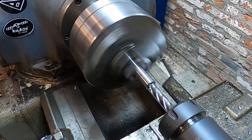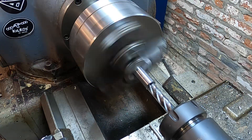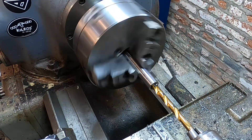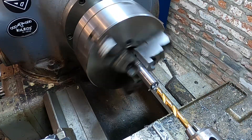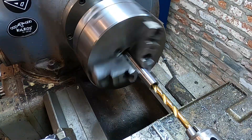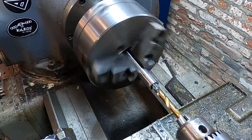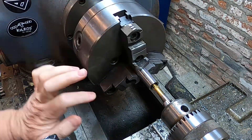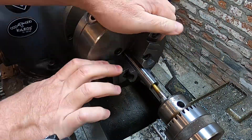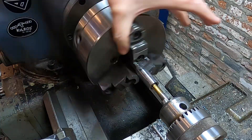Here I'm using a 4-flute end mill to make the counter-bore in an ER-40 type tool holder that goes in my tailstock — works great. This is the tap drill size for 3/8x24, so making some progress. Now we're going to tap the hole — all I'm really doing is feeding that tap in manually and just turning the chuck by hand. It is a blind hole at the bottom, so just playing it safe.